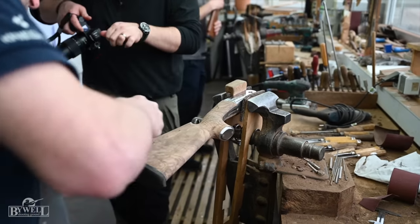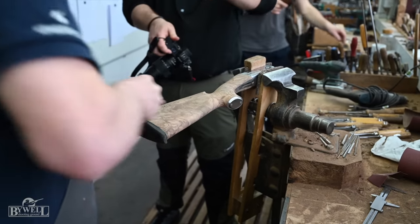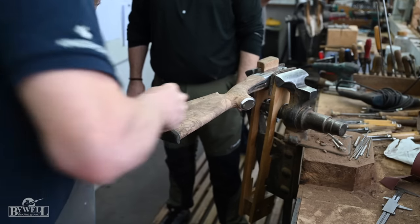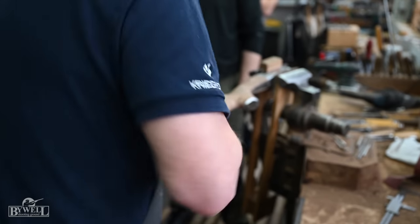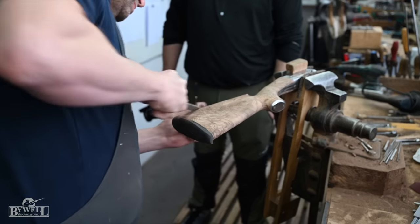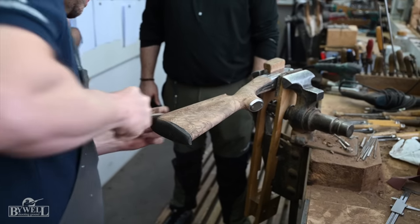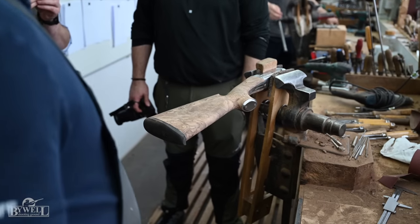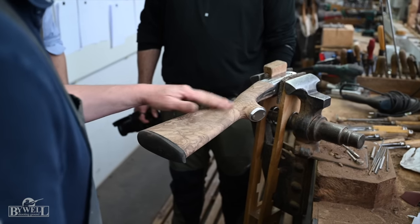Yesterday, when you were talking about how to use a file and the pressure differential, if you watch, you can see it in his hand. You can see the pressure differential changing across the file. And if you would look from the side, so you have the side view from the file, you will see that the file is keeping straight. It will not go like this. Not much. So just the other side and here the radius. And then ready for stopping.